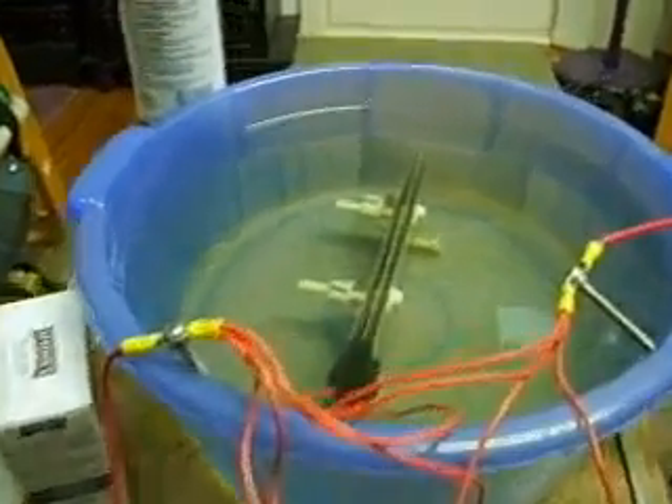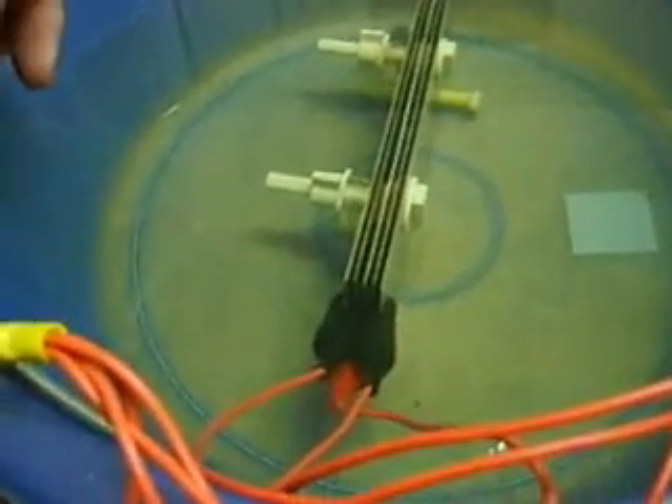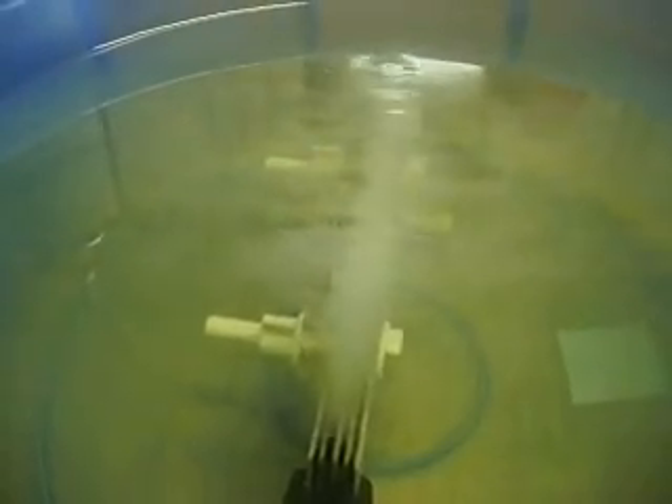So now I'm going to stop this and rewire it. Okay, now I've rewired this so that both the negatives are on the outside — so now it's negative, neutral, positive, neutral, negative. We're going to see how that goes. She's running right on 6 amps. By the way, this burner is on, and it's on for a reason — just so you can see that I'm not going to blow myself up. That looks like it's doing better than what it was before. I have two different theories on this: one is the spacings I've done to the plates, and one is to do with the wiring.